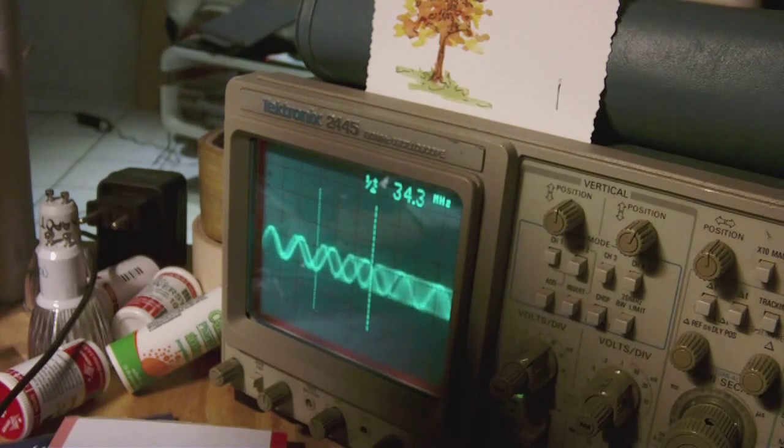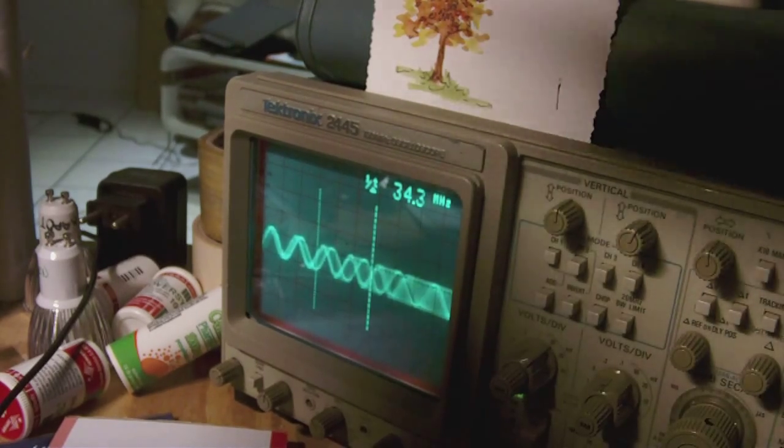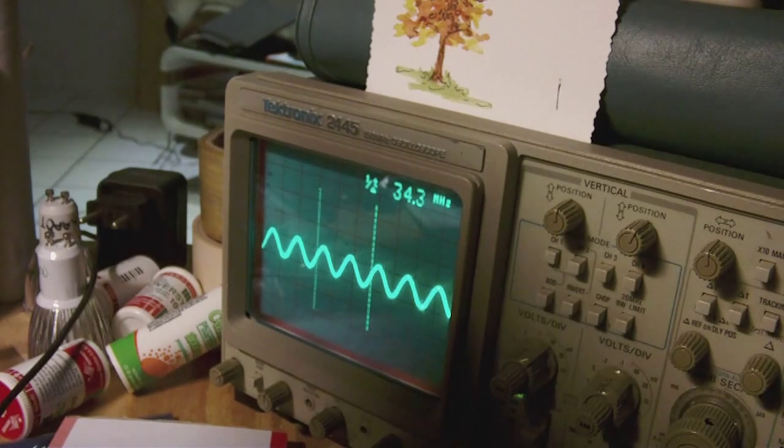So it turns out that apparently there was a bad solder point, which I seem to have solved by resoldering and cleaning all the solder points when I reinserted the potentiometer. So now it works perfectly. Which should also remind you that you should always keep solder points as clean as possible and make them as solid as possible. You should have a good flow of solder over the solder point.